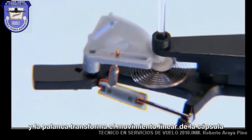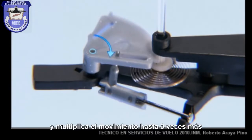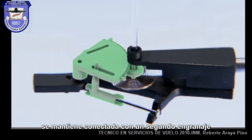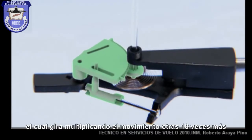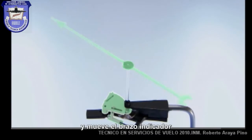Because of its greater length, the lever almost doubles the capsule's range of motion. And the lever transforms the capsule's linear motion into a rotational motion. Because the lever actions the gear very close to the gear's axis of rotation, it multiplies that motion up to three times more and rotates the gear. As that gear rotates, its teeth lock in and engage with the teeth on a second gear shaped like a wheel. That wheel-shaped gear has a very small diameter, which, as it rotates, multiplies the motion another eighteen times and moves the indicator arm.